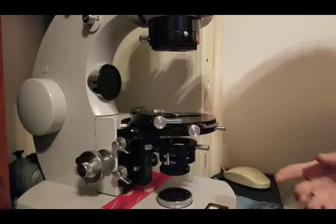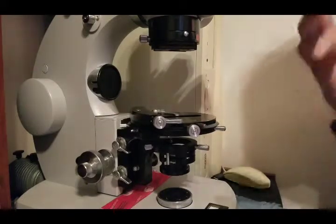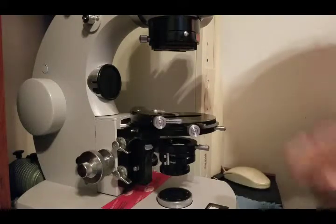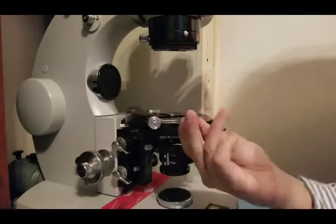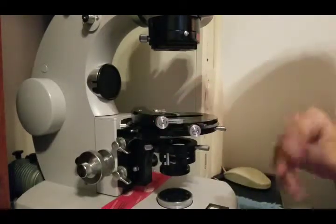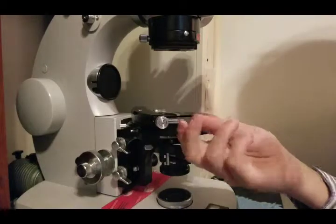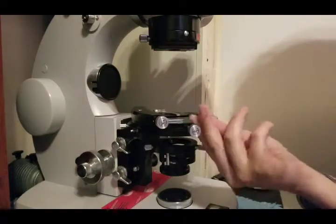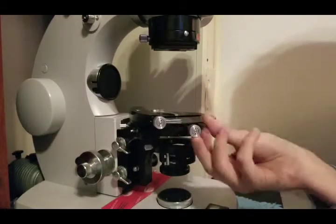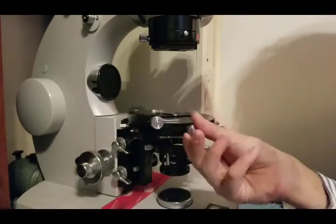On modern microscopes they have that bar that sticks down with the two knobs in conjunction with each other to move the stage X and Y. That's nice, but I don't like that style. I like this far better, where you can just do this and move it right on the stage, so you don't have to keep moving your hand up and down to look at things. It's very nice. And of course it has a set screw so you can keep it from moving. It's a really nice smooth stage.